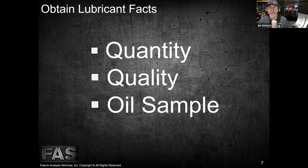Maybe 2 hours, but regardless, most of the companies that are out there take periodic oil samples, so they have a history of it as well. But anytime that we have a failure or a problem in a component or a system, it's always a great idea to take an oil sample just so you have that information, right? So first and foremost, it's important that we take the sample the correct way.